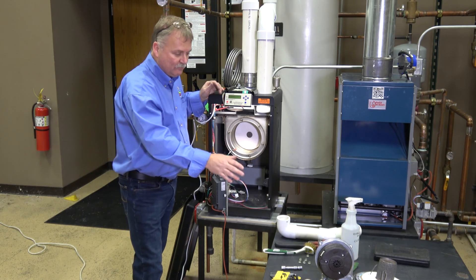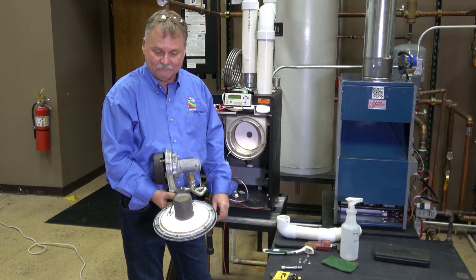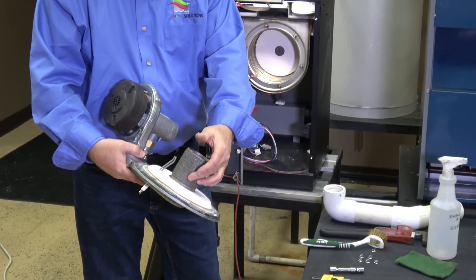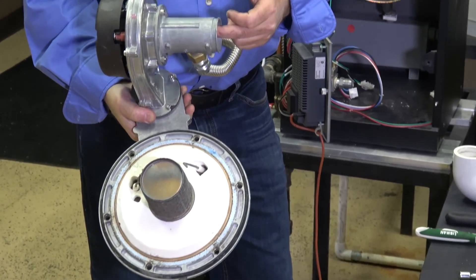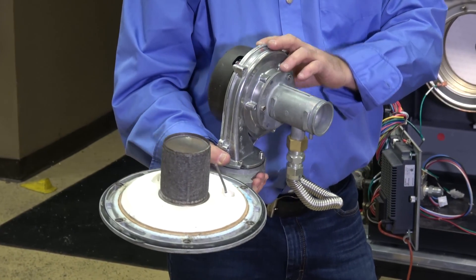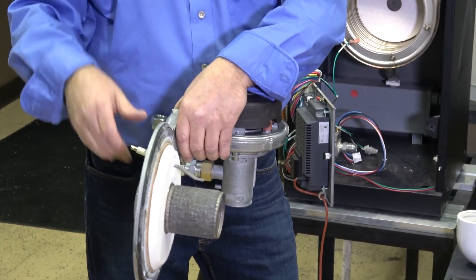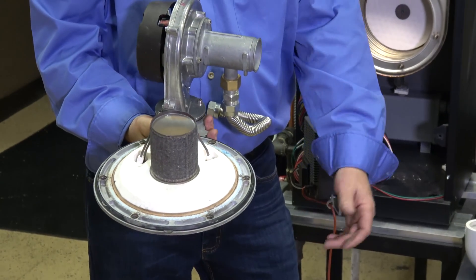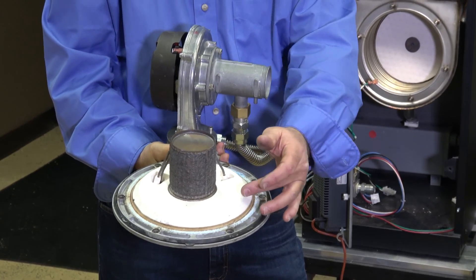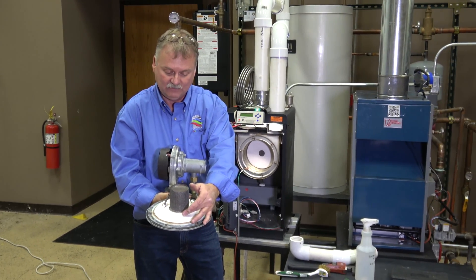Let's go back over and look at the actual burner door, the blower, and the other accessories here before we put this back together. This is the actual burner on this boiler — our combustion air comes in here, our gas comes in here, gets mixed here, and this is our blower motor. It shoots it down the burner tube and into the burner. While we've got this out, just like the target wall, this is called the front refractory — same material. I want to look for any moisture line. If there is, that means I've got a condensate issue — it's backing up. If there's not, I'm good to go.